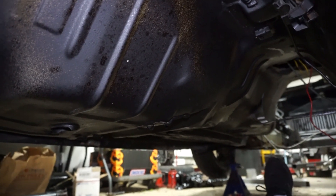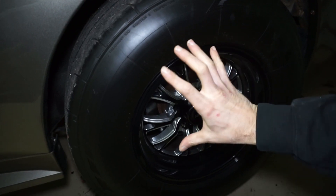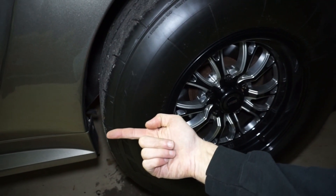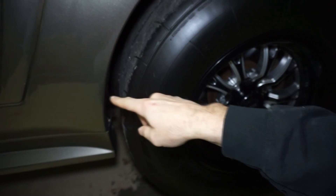The long bracket essentially gets welded onto this section, bolted to the seat bracket for support, and then welded up to the front subframe to keep the back of the car from trying to push forward without the front going forward. When you launch the car, the wheel goes forward and the axle wraps the opposite direction, pushing that lower control arm forward. The torque box reinforcement will really strengthen that up so the car pushes forward instead of ripping those spot welds out.